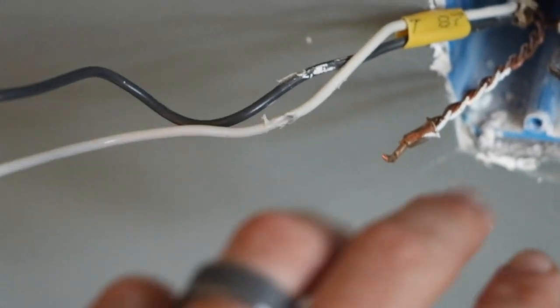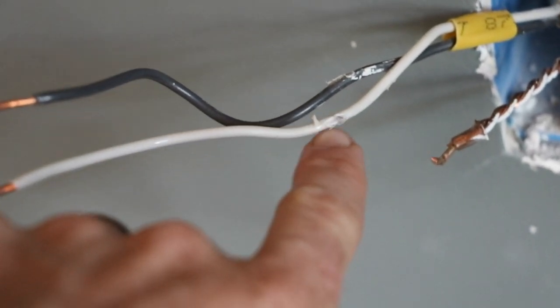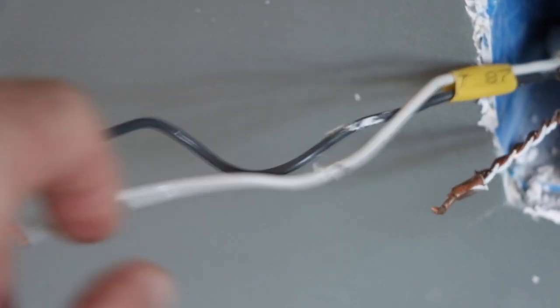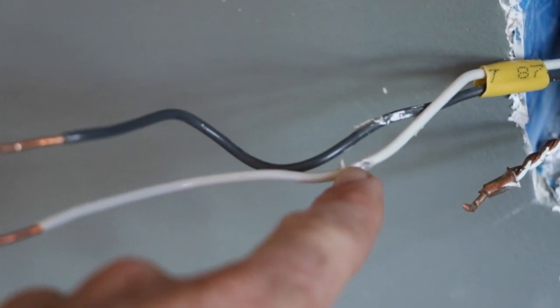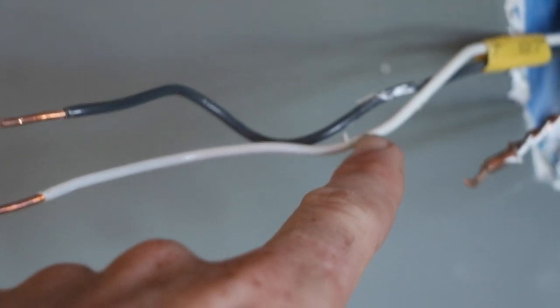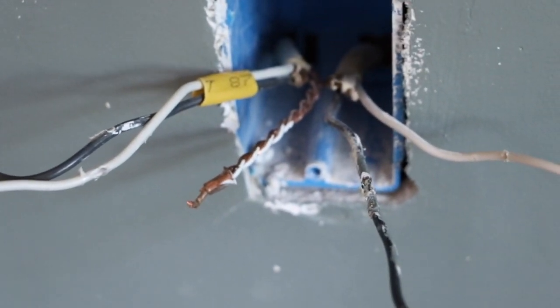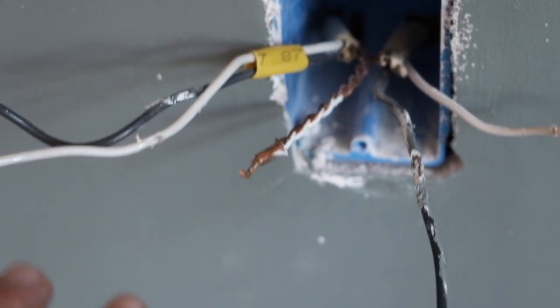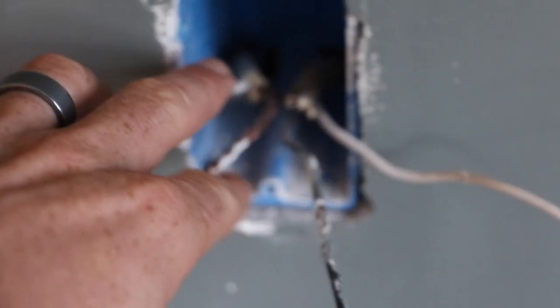Now, if you could see this right here, this is a combination of the drywall guys and people not paying attention when they wire up the outlets, but when the drywall cutters come in and cut this out here, a lot of times their cutters will nick a wire. Don't want any of this exposed inside your box. So you gotta pull them out further, cut them back, and remove these nicks. That one, that's real bad. So those nicks can't be in the wire. That's gonna cause something to arc, somebody's gonna get shocked. Here you can see a little piece right there.